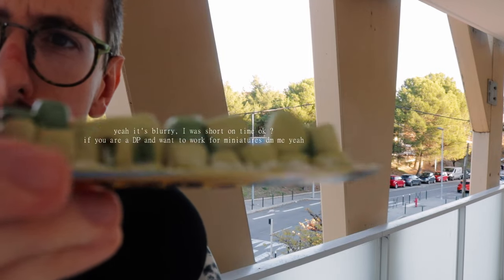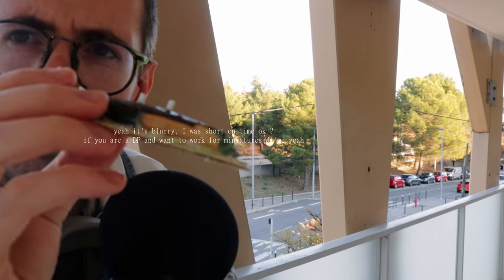These were my original sprue designs and I was inspired by everyone doing actual useful sprues — it's good to save resin and I wanted to save the environment. My idea was that if models went on sprues that were this big, they would save silicone by being grouped up instead of having a bunch of individual molds. However, I think I got a little too cute with it. The sprues ended up way too bulky, so I didn't save as much space as I thought. Two of them were made of wood that wasn't sealed properly, which meant the silicone started bubbling around them while curing because there was still air in them. Overall, they were not super well constructed — fiddly and kind of a mess.